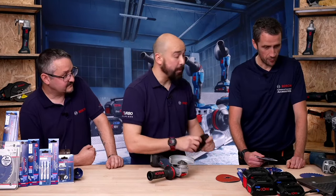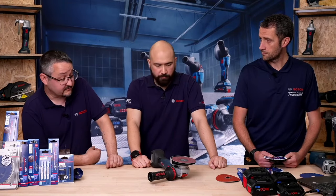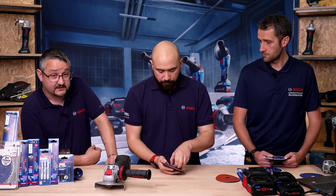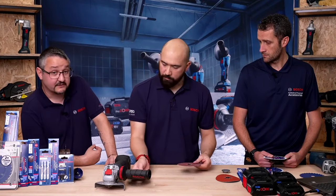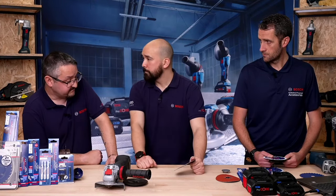As you can see from that video, the performance is really, really good. When we do our training with the bonded abrasive wheels and discs you're used to using, when you step up to a Prisma it's like you're literally wiping away the weld — it's so quick and so fast. I've been doing welding in my spare time and I always used flap discs for removing weld material, but I've tried the X-Lock Prisma and it's honestly night and day — really fast material removal and really controllable.